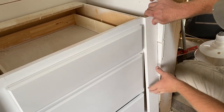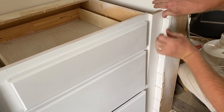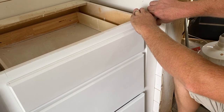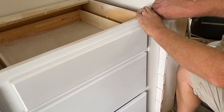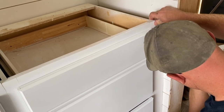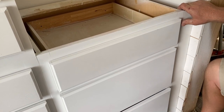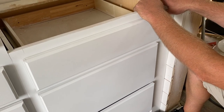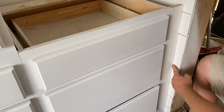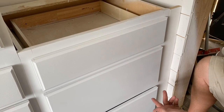This side is pretty narrow — we don't have as much gap like we do on this cabinet behind me. I just cut this filler strip out of trim and it's pretty tight, but I'm gonna nail this in and then we'll do trim down below. This won't have a toe kick anymore — it'll look like a built-in old-time cabinet.